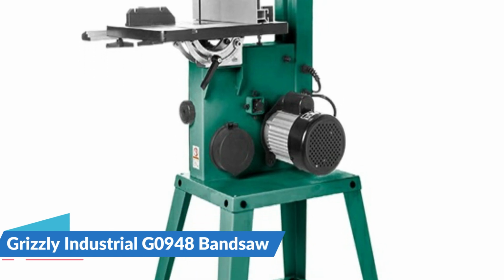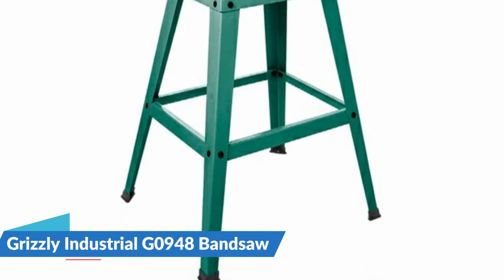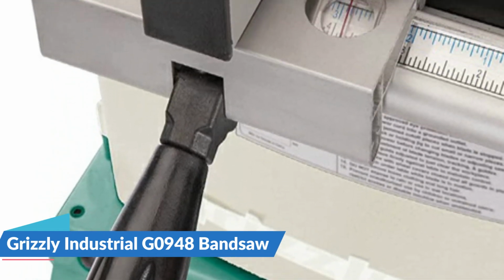Designed for convenience and accuracy, the G0948 features adjustable ball-bearing blade guides to prevent blade wander. It uses a 72-inch blade and accepts blades from 1/8 to 1/2 inch wide with enough power to cut through green woods and other dense materials.